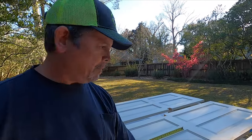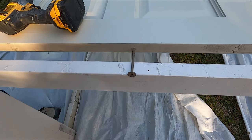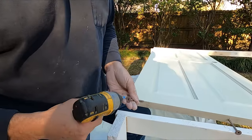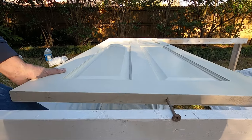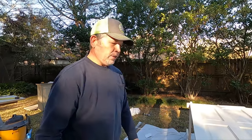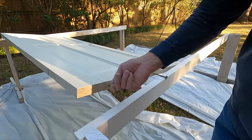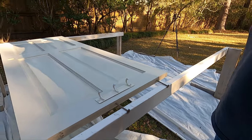I've moved this horse out so the screw is sitting on it. I just made these from two-by-fours and two-by-sixes — I use them just for painting doors. The next step: take a third screw and put it on the heavy side. Since the screw placement is off-center, that's the heavy side. Here's how it works: I spray this side, then I come over here, grab that bolt, flip the door over, and paint the other side.